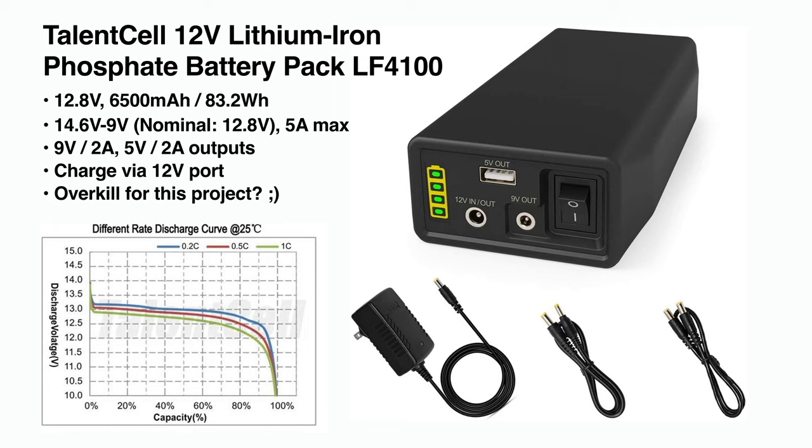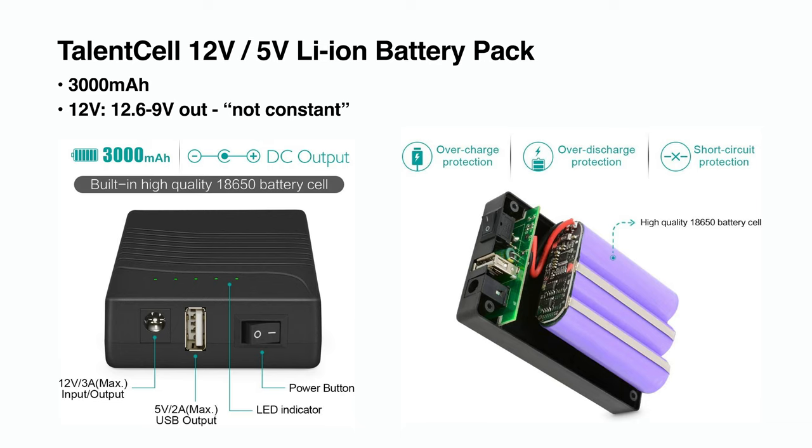Let's talk about power supplies. I feel like what I ultimately chose was overkill for this project, because these batteries ran for a month before I had to recharge them — I was quite impressed. I haven't been able to measure the current taken by the amplifier, but my guess is they really don't take much power. What's impressive about this battery is that it has a very stable 12-volt nominal output throughout its life cycle, though it is the pricier of the two options I looked at. The second model, also from Talent Cell, offers 12 volts and 5 volts via USB at 3,000 milliamp hours, with output ranging between 12.6 and 9 volts, so you get more of a natural decline in voltage — but you have a good price advantage there.